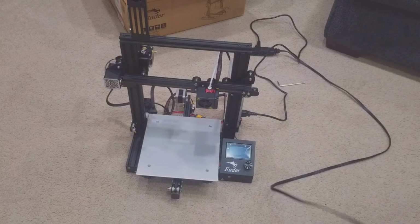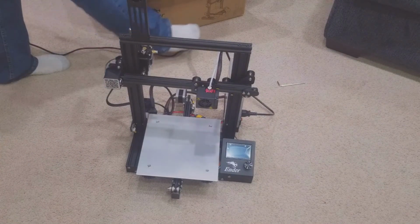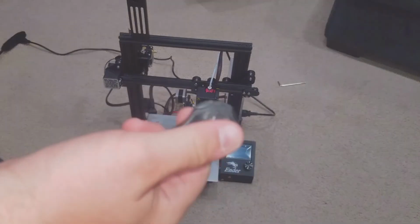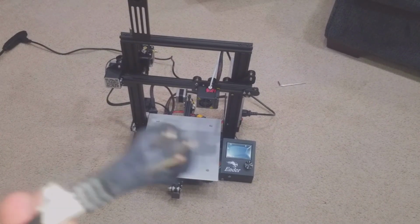Okay, here we go. It was set to 230 volt for some reason, but it comes with a 115 adapter, or 115 cord, which is America. So that's kind of confusing. It should be set to whatever power cord it comes with, because this style of power cord is not 230 volt. So that's kind of weird. They almost want you to blow it up, I guess. It'd probably just air out, because if you're only supplying 110 and it's trying to make it 230, it'd probably just whine or something.